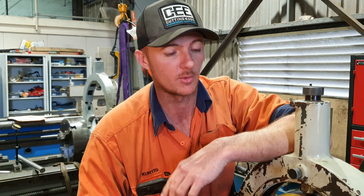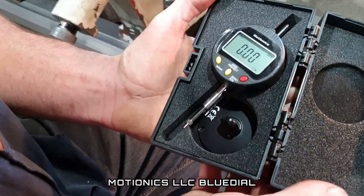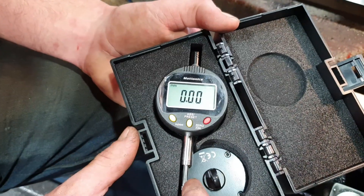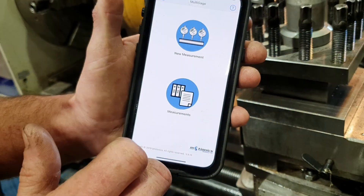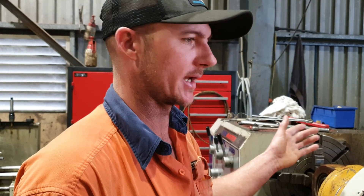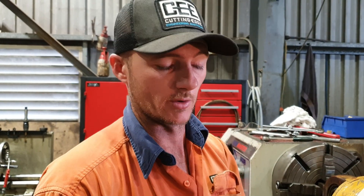I was chatting to my tooling supplier and told him what I was up to, and he said he had something he'd like to send me and wanted me to give it a go. What it is — this is a Bluetooth Motionics dial indicator, made in the USA. Nice and easy to read, nice big numbers, very repeatable, very handy when you're on your own. You can attach these to boring bars and put them right down the inside of a job. Connect it up to your phone or your smartwatch — you've just got to download an app for that. And then you can work alone this end while everything's happening on the inside. I'm going to set this one up and show you how it works.